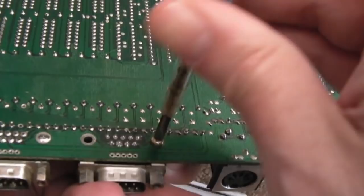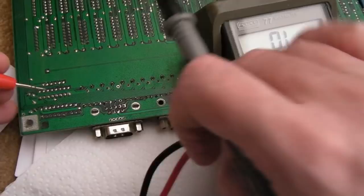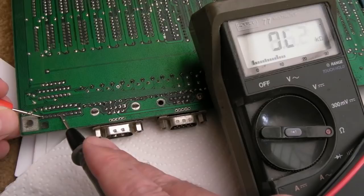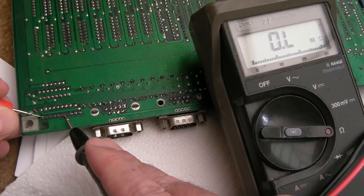I think it must have been the corrosion here, actually, on the other side, underneath where the connector goes and joins the PCB. Because if I measure from here now, this pull-up before, remember, it was like 4K7, and then we had a difference on the next pin, it was like 120 ohms. Look, 4K7. 4K7. 4K7. 4K7. You can see the pattern now, they're all 4K7.